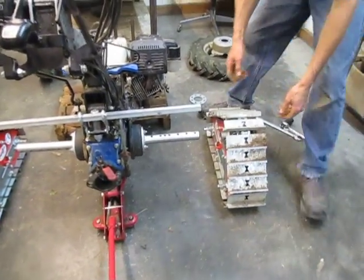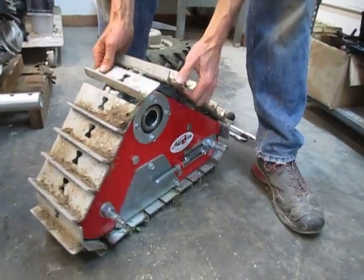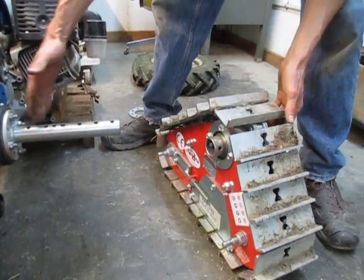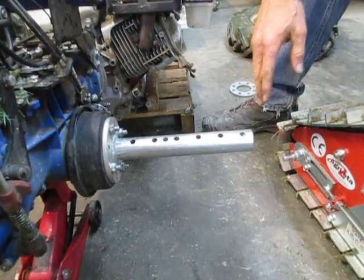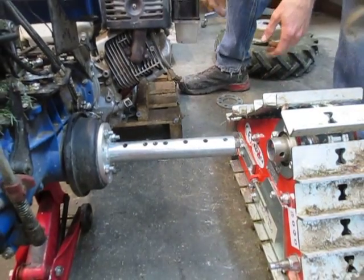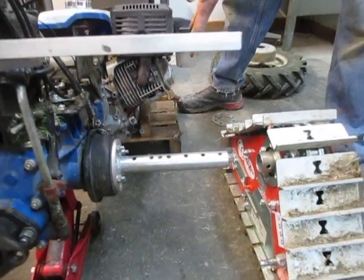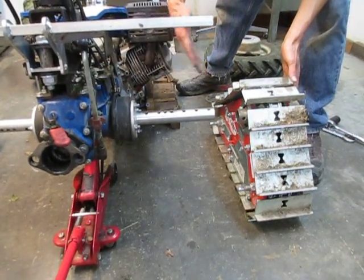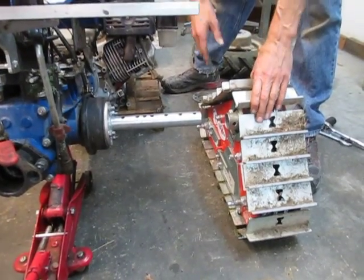Now I'm going to put the tracks on. You can see there's a collar that sticks off one side with a hole in it that's going to line up with one of the holes in the axle post. The various holes allow you different width positions of the track, which is very handy — in some cases you might want the machine narrowed to get through a narrow opening, in others you might want it wide for maximum stability on a slope. Also certain implements like moldboard plows and rotary plows are fussy about the inside dimension between tracks. For the rotary plow, the inside-to-inside measurement should be somewhere between 16 and 18 inches.